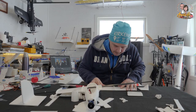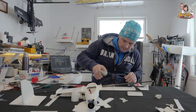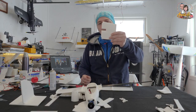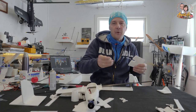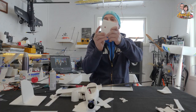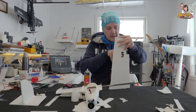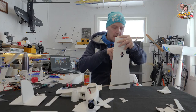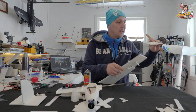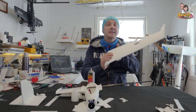Let's put them on the table so that we have the correct alignment. On this wing part you see that you have a hole here and that is for the landing support, which you just slide in here like that. Make sure to get it all the way in. In the servo section you have a hole for the screw for the shortest rod, and also on the end section you have a hole where you can put a screw into the longest rod. There you have it — the wing.